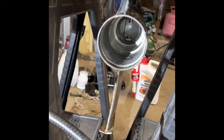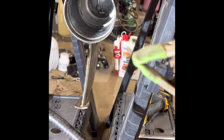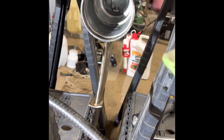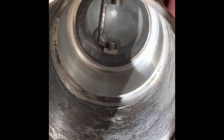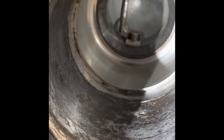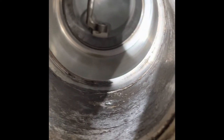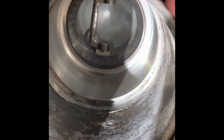This is the lower end drive of that Alpha 1 Gen 2. This would be the bottom section where you get all your seals. Right in here - I don't know if you can see it - there's this leg. See if I can zoom in on it for you here. It's right at the very back of the drive. There's this leg - you've got to slide this drive system back into this leg. But before I slide that in and show you how to do that, you want to look at your bearing face. The race itself is in excellent shape, so I'm not going to mess with any of that.